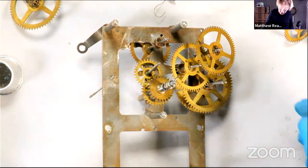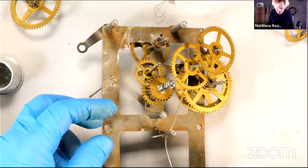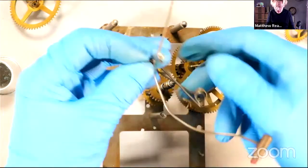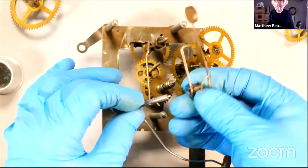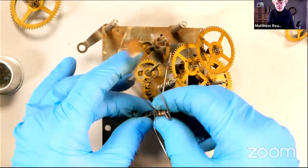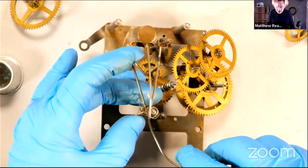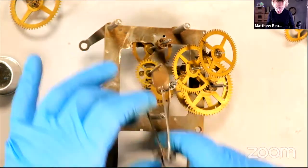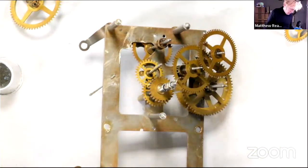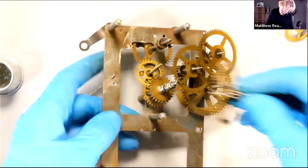What else? Then we've got our hammer, which I think I can sneak in after. And that's coaxial with this thing that strikes the bell on the passing striking. So got all my springs in place. I think if I'm right, I can get that in once the plates are actually put together. So no panic there. Got that in there.